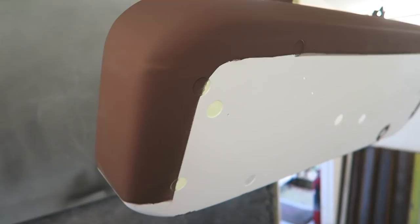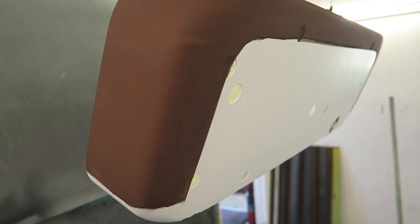I really don't think it matters, because the manufacturer says to rub it down now with 240 to start with, so something quite coarse, 240, 320, and then go through a process of using Scotch-Brite pads to buff away any of the paint to reveal as much of the metal to the surface as possible.